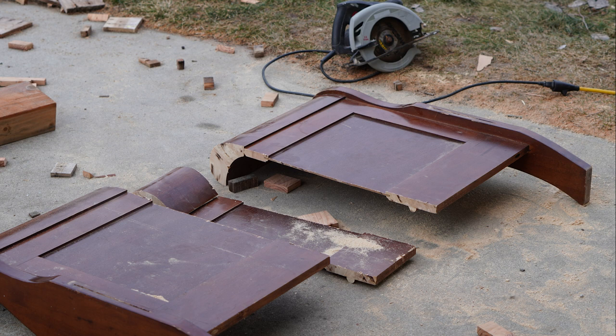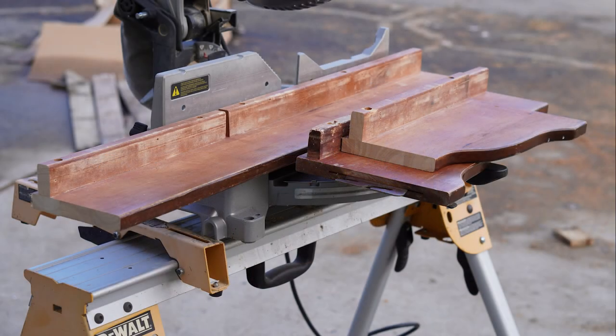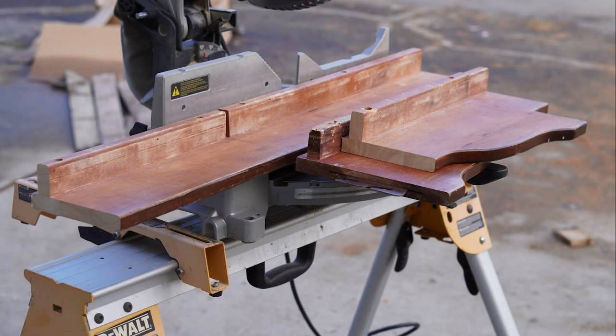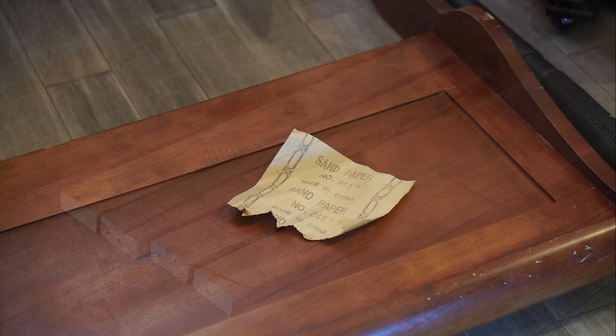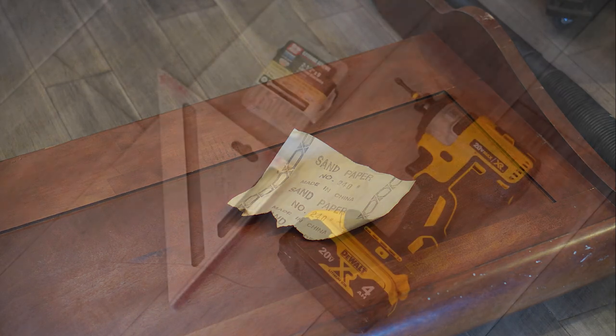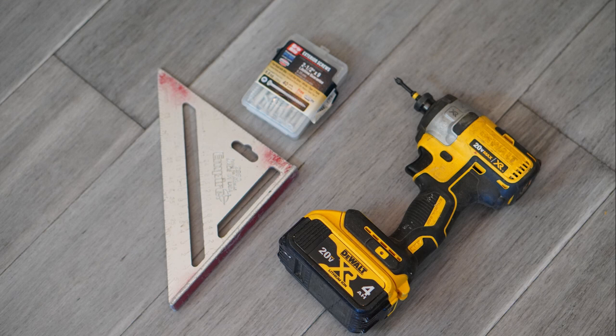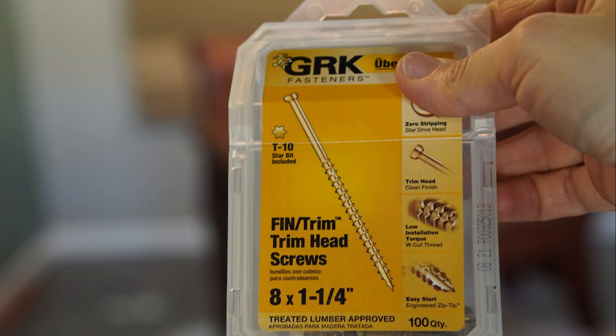I felt like cutting it in half made the bench too deep. And for sure, for people like me, that's a big deal — your little legs are sticking out straight and you're slouching funny. So figure out exactly how deep you want yours; I went for about a foot. That's a good distance. And initially, what I did is use the circular saw to just cut out a center segment. That didn't work super great — try cutting a straight line on a curved piece of wood. Not so fun.